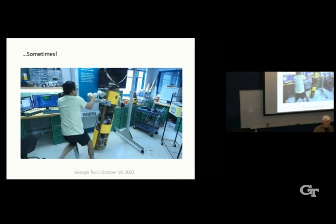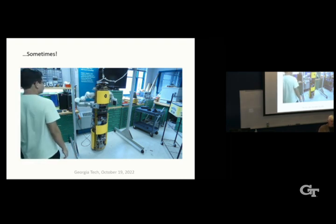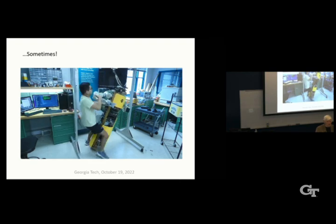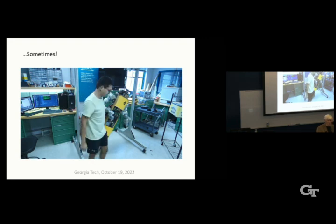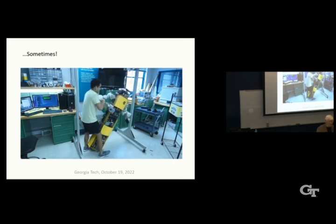Speaking of the HRI tasks, when you made those new 7 degrees of freedom arms... Yeah, Roberto did. We want it to be able to lift a heavy payload, and those arms can lift 22, I think it is, kilograms, just like that. The actuators are quite powerful, but the arms also had to be light, and if you plot the available arms, Roberto's arms are way up there in performance versus mass.